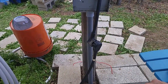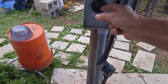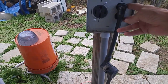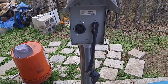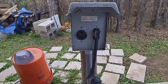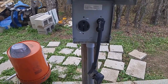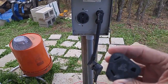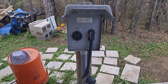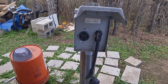I carry all kinds, and the reason I do is because I've run into all kinds of problems on the road. Sometimes you'll run into a place where the 30 amp or the 50 amp plug is there, but it's not active. But they'll have a double 110 on one side, and that'll give you enough power to run most of your items most of the time. But you just have to be aware — if you use an extension cord, be sure you get a good extension cord, because I've used just a regular extension cord plugged into the 110 and then used this adapter to adapt to my 30 amp plug. Works okay, you just don't want to run too much. If you've got two air conditioners or whatever, you're not going to be able to do that off 110 very long. But I'm not an electrician — I just wanted to show you some of the different things that you might want to consider carrying with you.